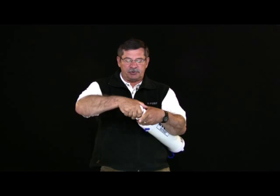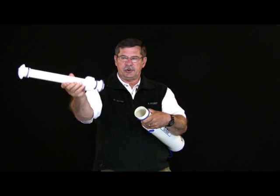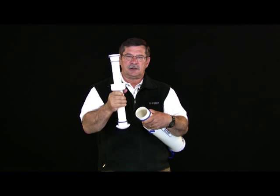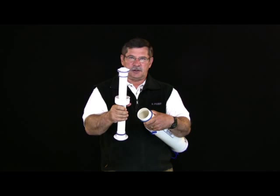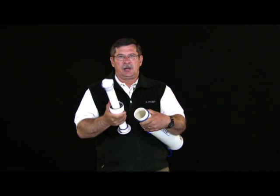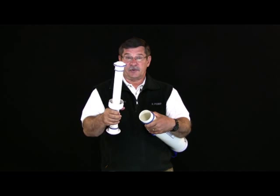Then what we do is grab it — you've got to twist the cap to release the plunger — and then grab the plunger and just pull the whole unit back out. If you look at this unit, it's identical to the K100 or K200 plunger unit. So go back to that video and study it to learn how to service this part of the pump, which is very simple.